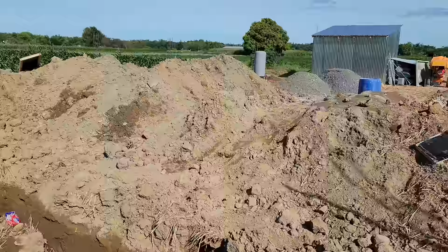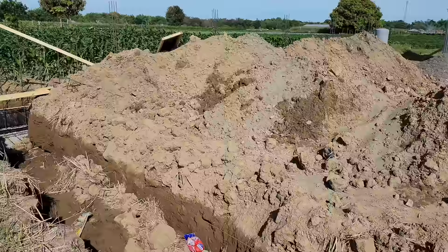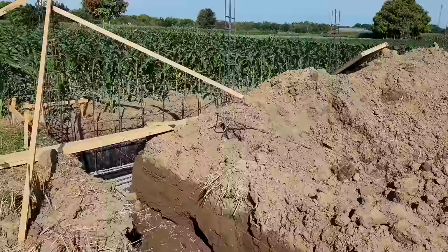Now this excavation you see on the side, most of that's going to be put back. That's not the actual backfill. The backfill will be spread out in layers and packed down, water packed, and then mechanically packed with the machine, so we can get a really tight backfill. So I'll give you guys another view of the backside of this property.